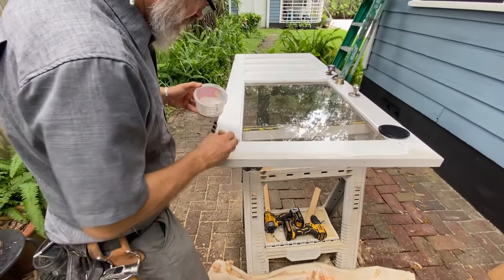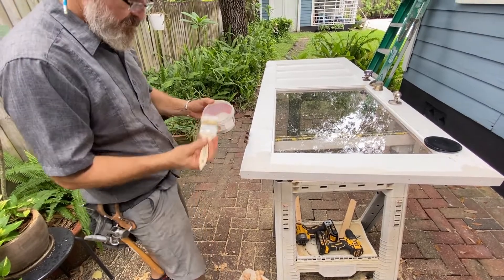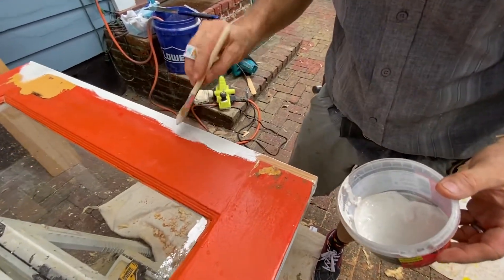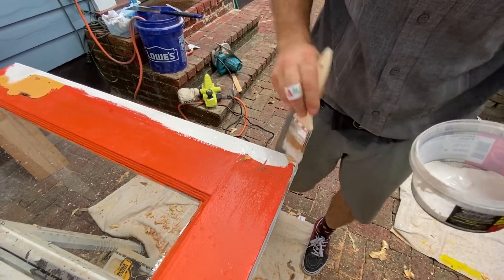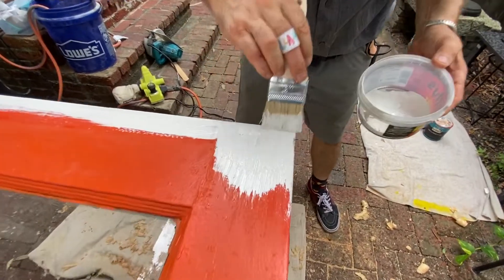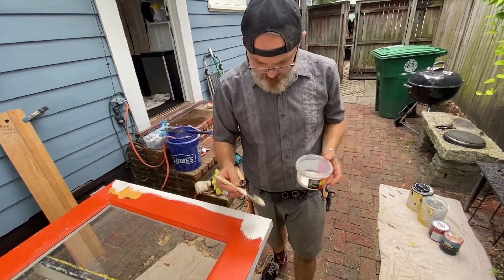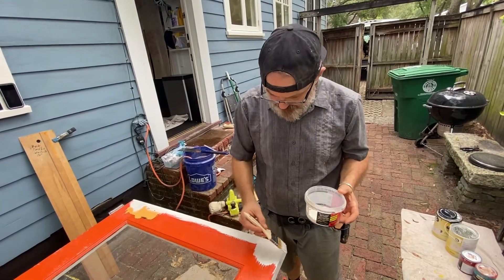See how I'm mimicking the direction of the wood with my paint lines. Oh yeah, there's that scar we made — the intentional scar. It kind of covers up the transition a little bit. I'm gonna fill it there. See, that's another thing people don't know about oil-based primer or primer in general — it's meant to be a filler. See, it filled my little groove right there.